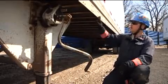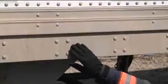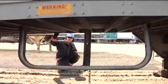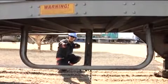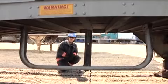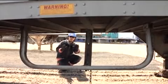You can read the floor joist locations from the outside by the rivets on what's known as the rail. On the underside of some trailers, there'll be a bracket in place to hold simply a spare tire. That is not an acceptable spot to put cribbing. Any time that we crib, we want to crib up to the floor joists.